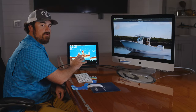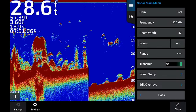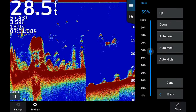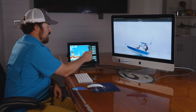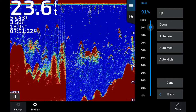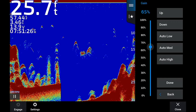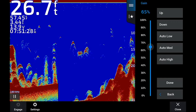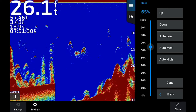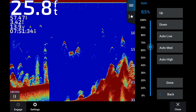If you want to clean the unit up a little bit and adjust it, you can go into your settings and mess with the gain to clean it up. You can take away some of the interference on the bottom or you can add it. Sometimes it gets a little too messy, so you can just go down and take some of that away. You can still get a lot of your bigger marks and clean up that bottom mark, and you're still picking up the baitfish schools and the bigger fish hanging around them.